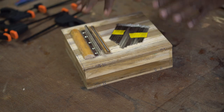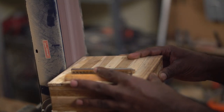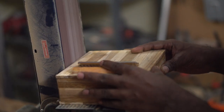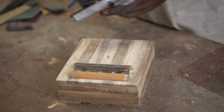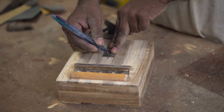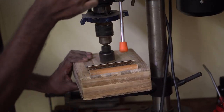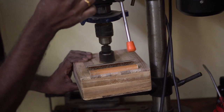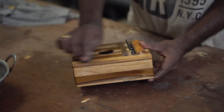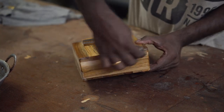While the parts were drying, I took the time to arrange all the tines in order so that work becomes a lot easier when I start inserting them. Once again, before attaching the tines, all of the sides and edges were sanded smooth to touch, as that was the finish I was after. There needs to be a hole in the center on the top piece of the box for the sound to resonate, so I made a sound hole. Finally, coating it with oil brings the wood texture to life — this is always my go-to finish.